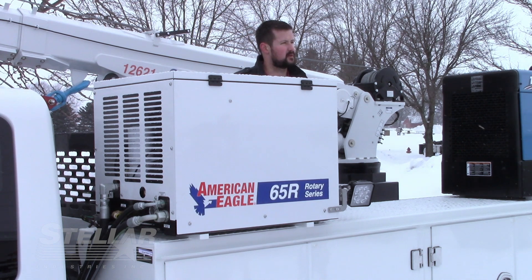If you don't run these compressors long enough, moisture and condensation can build up in there, and on your way to your next job it can freeze. That's not going to allow your compressed air to run through your filter and get to your tank, and it's going to blow your pop-off valve off.